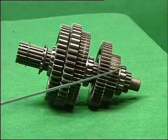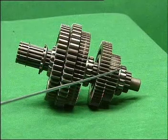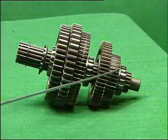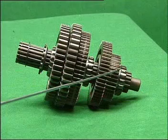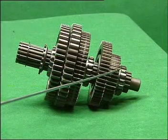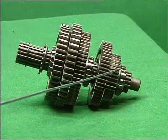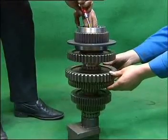Finish all procedures of the main shaft sub-assembly. Clearance between 3-speed and 2-speed gears interfaces should be within 0.13 mm to 0.3 mm. Clearance between 1-speed and crawl gears interfaces should be within 0.13 mm to 0.3 mm. Clearance between reverse gear and driving gears interfaces should be within 0.30 mm to 0.90 mm.